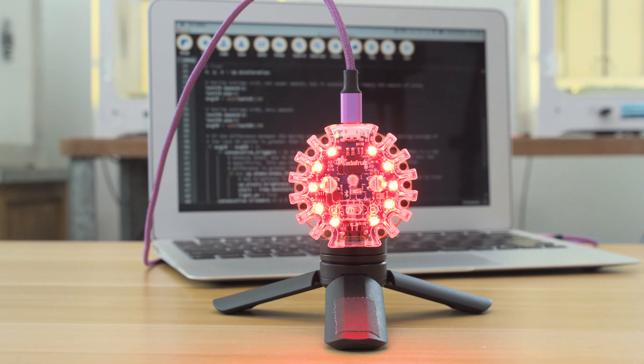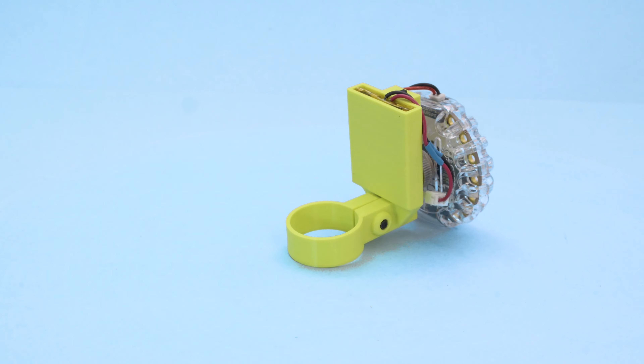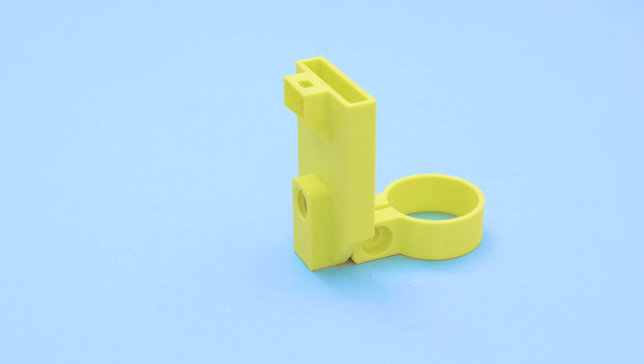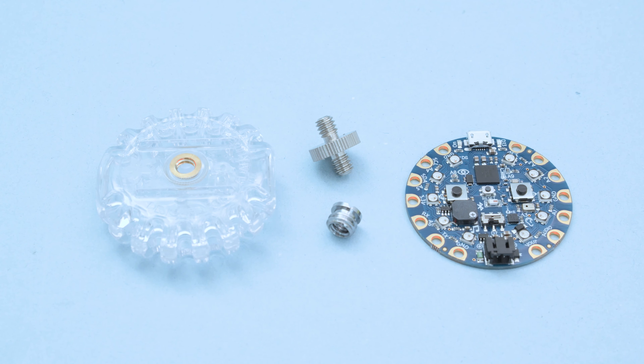Check out the guide for a full breakdown of the code by Dylan Harada. The bike mount is designed to be 3D printed without any support material for a stronger and more durable part — you can use PETG filament. This uses the clear case for the Circuit Playground and a tripod screw adapter.